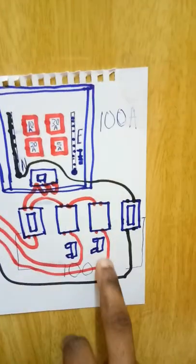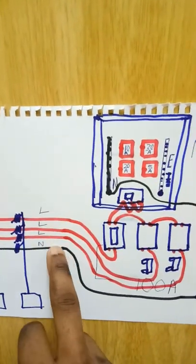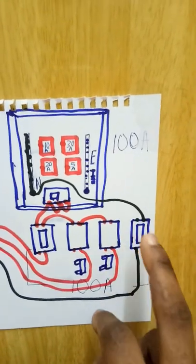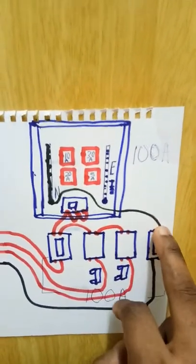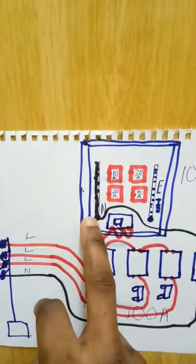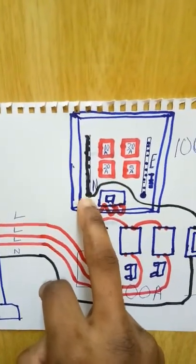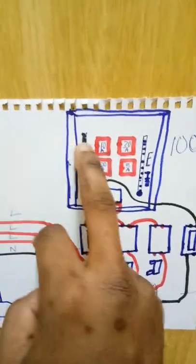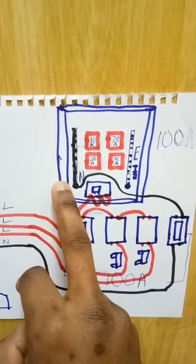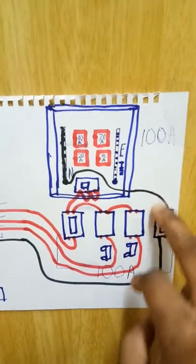You use one phase at a time, that is why you put only one cutout fuse and the neutral cutout fuse. The last cable is the neutral cable — you bring it down and from the top take a wire down to the copper rail that has a lot of screws where all the neutral wires come. The earth wire is connected to a wire that will be buried in the ground.